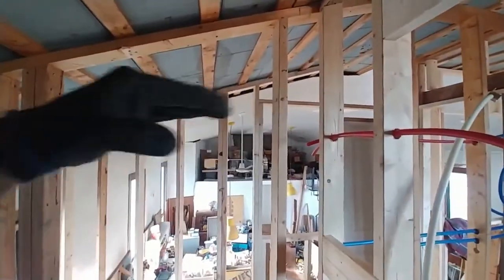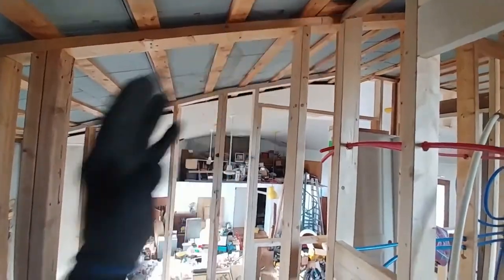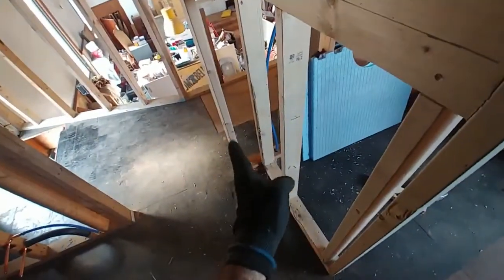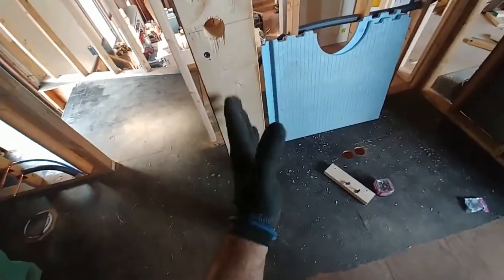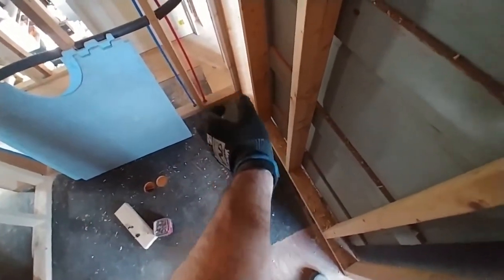So in order to go up with it, I had to go over with it, because as you know, the outside corner goes over, it can go higher and higher and higher. So I wanted everything I could get to the right. Now this is at the old door king or jack position. It's not technically a jack, but that's at the old position where the jack was for the door. I have another 3.5 inches here now, because I scooted this wall over 3.5 inches, and I had the ability to do that in the end, because my buddy, the way he had framed this, he'd framed a second wall